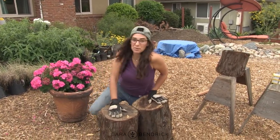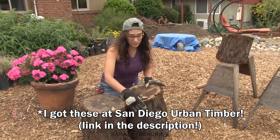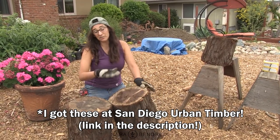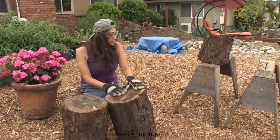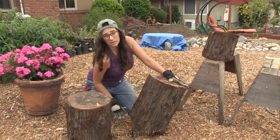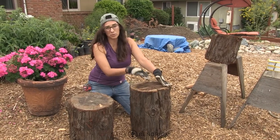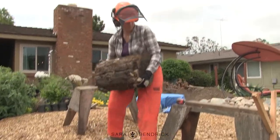I have my redwood stumps. I love working with redwood. I got these at the yard — they had them cut for me. They're not exactly level, but that's okay because I can level them in the ground or cut them flush. I'm going to put this on a base of gravel so it'll have nice drainage and won't rot out, instead of putting it in soil which would rot it quite quickly.